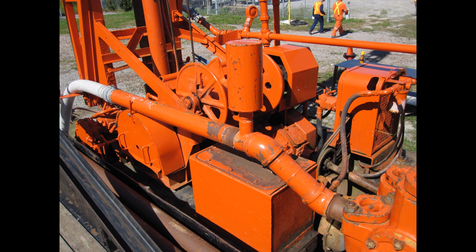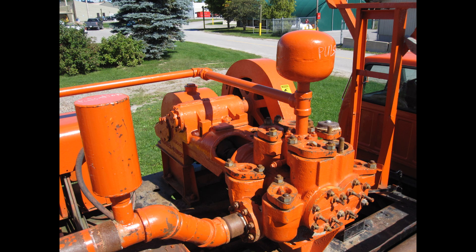As the mud is sucked up the hose, it goes down the piping, past the pulsation dampener, and slightly downgrade to our pump. This is a positive displacement piston pump. It is a 5x6, which means it has a 5-inch piston with a 6-inch travel. It has two cylinders. This pushes the liquid mud down a line, past a second pulsation dampener, then on down the line.